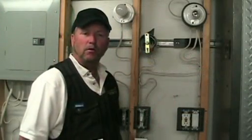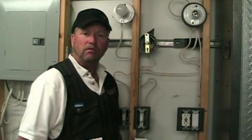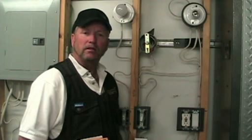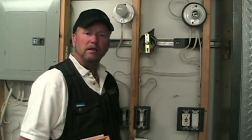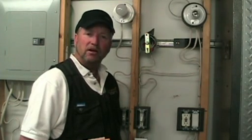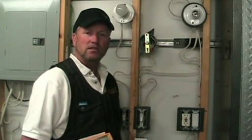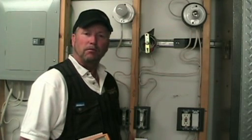So if you're willing and capable of doing your own electrical repairs, additions, or renovations, and you've checked that it's okay with your local authority and got the proper permits, then it's very important that you do purchase a good electrical meter as part of your tool kit. It doesn't have to be a really expensive meter, but it should be UL or CSA approved and should have the functions of resistance and voltage testing, and to a lesser extent current measurement. For most situations you won't need current measurement — you're just looking for continuity and the presence of voltage.